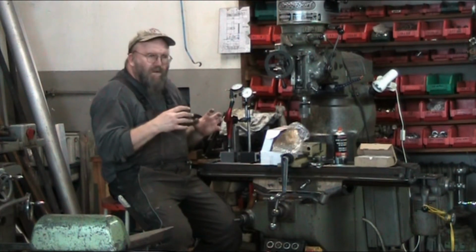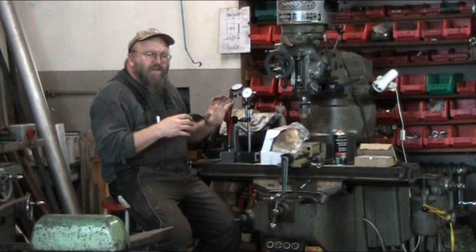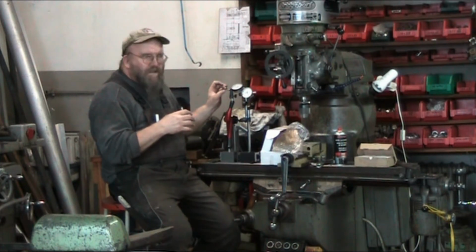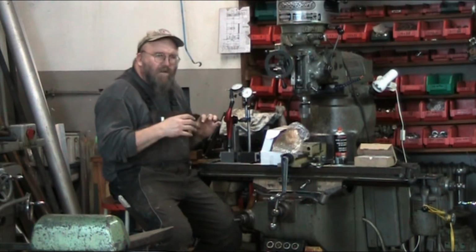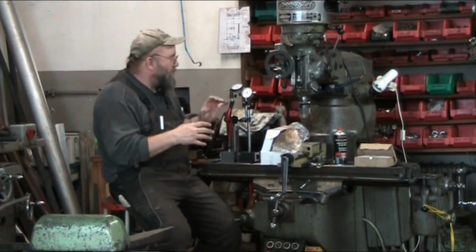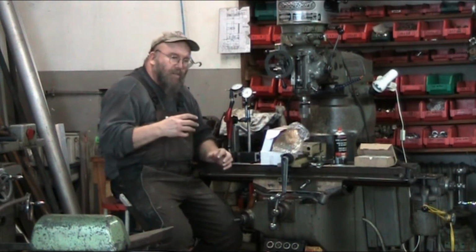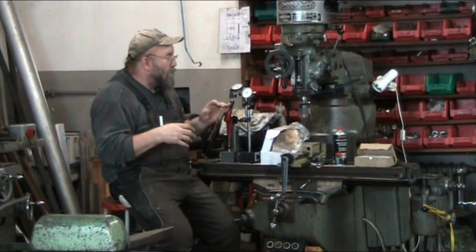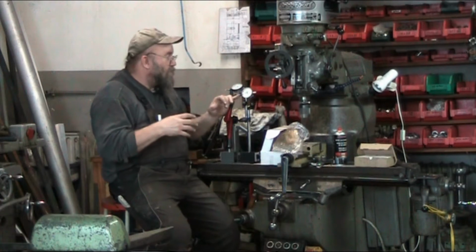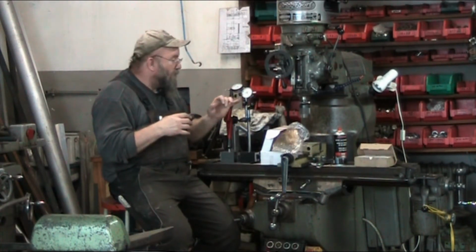And so when you pick up the slack, when your spring is putting compression on the pin resting against the work, the arm should be rigid enough to where there's no motion in the arm, just in the mechanism of the dial indicator. So that's what we're going to be checking out today. Rapid movement will cause, because the spring doesn't have time to compress, some movement in the second dial indicator.